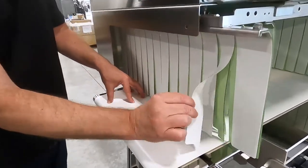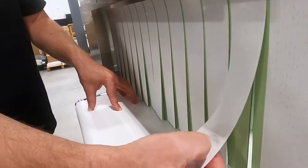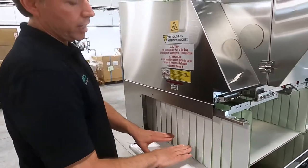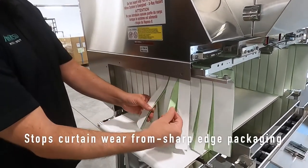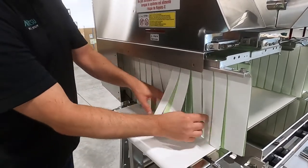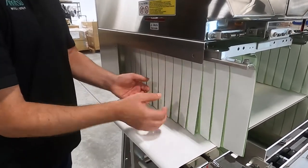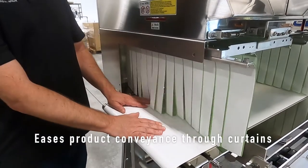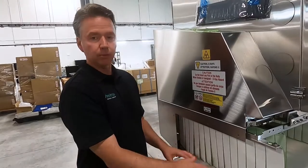The last thing they added were these low friction interface curtains. What that does is, if you have a sharp box edge like a carton, it can help take up some of that wear so you don't wear out the actual curtains. It also helps with the friction interface — these curtains do have a rubbery type coating that could grab a package, and this helps it slide through the curtains easier. A really nice solution for any type of co-packer that might have different sized products or maybe some lightweight products.